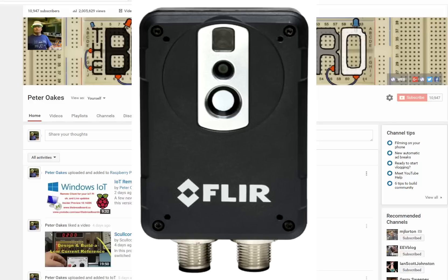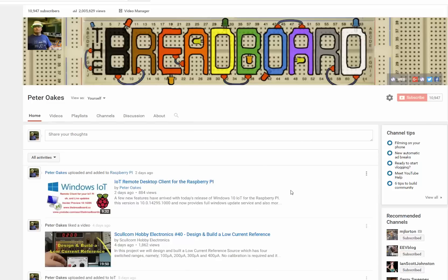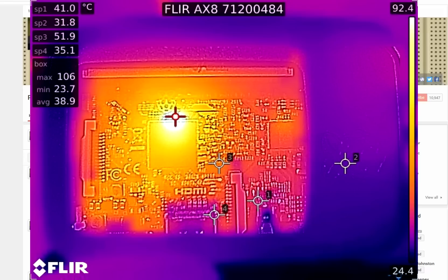Initially, I was skeptical that the CPU would have been running as hot as it is. But at the end of the day, I was wrong. It actually is getting and exceeding 100 degrees. The highest temperatures I got was about 110, 111 degrees centigrade. And that's just running Sysbench, generating prime numbers with 32 threads. So the CPU was maxed out.